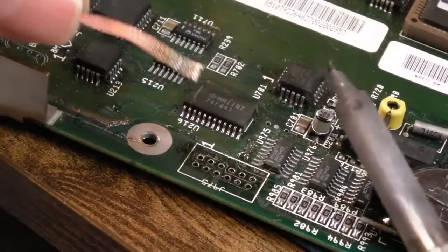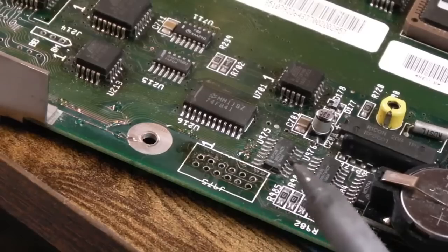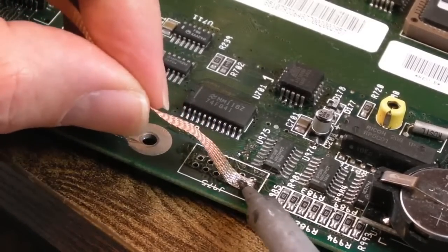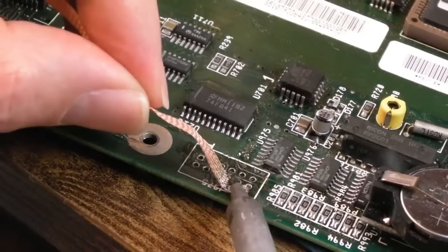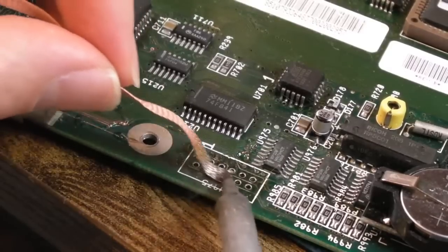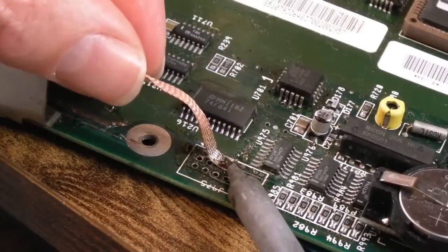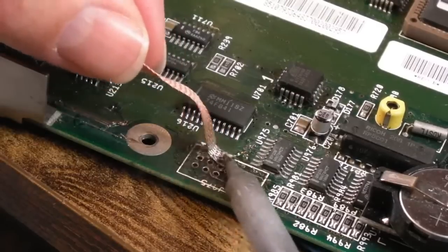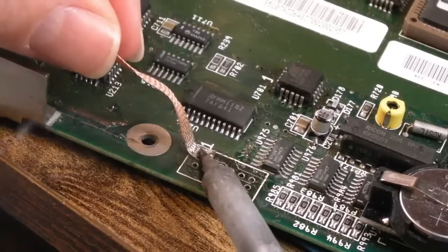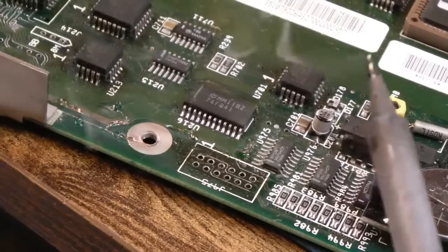And as I've said in other videos, it's sometimes a two or three phase thing. So what I mean is, you clean up now with IPA, inspect, you might find there's one trace that's not tinned enough. I can see one on the bottom there. Let's just go over that. And I haven't scratched that trace. The solder mask has worn off it. So just by virtue of going forwards and backwards there, the solder mask is so thin. There you go, we've tinned one of the traces that go to the pad, and that's a good thing, because it's not then going to mysteriously have a fault at some point where you're like, what's going on? And it's like that one trace has, I've done that one as well now, that one trace has kind of gone open circuit and you don't know that. I mean, those are the sorts of faults that would be really blooming hard to find.